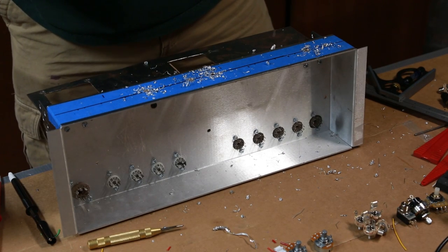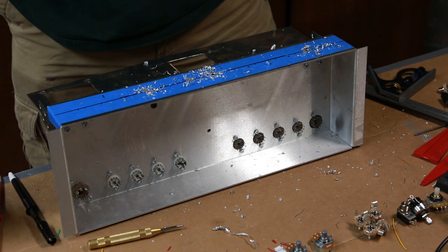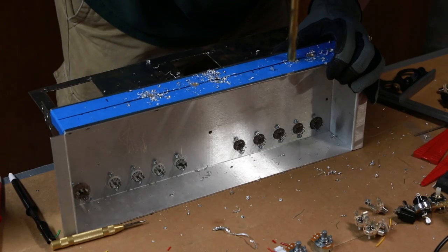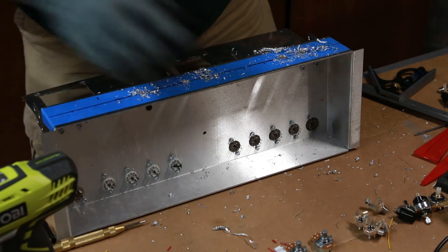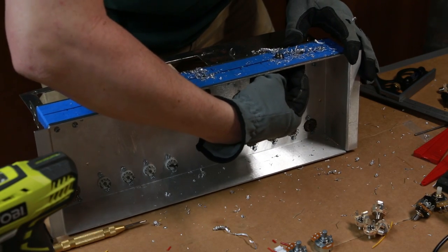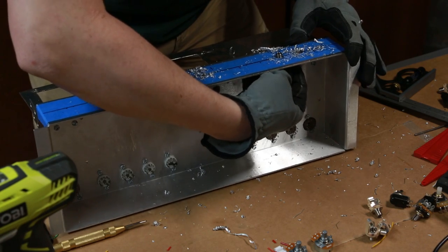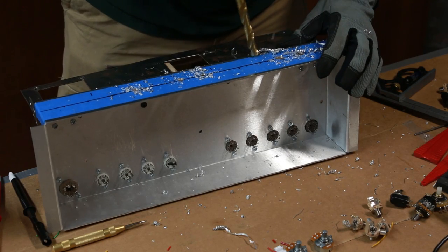Now I'm going to need to change bits because I noticed that the input jacks and the power switch sized ones are quite a bit larger. Once I have one hole I just quickly validate all of them. We've got our jack switch in there — that seems to be just the perfect size. That's absolutely perfect. So this largest one will now be what I also use for my input jacks.